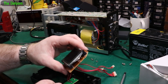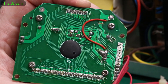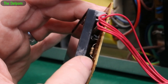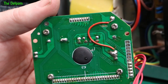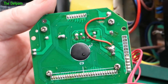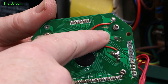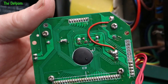It's an embedded LED — that's a shame. But there's something interesting here — a bodge. That track there is actually going around to the LED. Look at the state of it — there's a series resistor and it's been bypassed. So that's been done to probably increase the brightness of the backlight by someone — not by me. Because if it was me, I wouldn't have cut that track. If I'm just jumping a resistor I wouldn't have cut it. So that's not me — someone else has done this. That must be a factory modification or something.